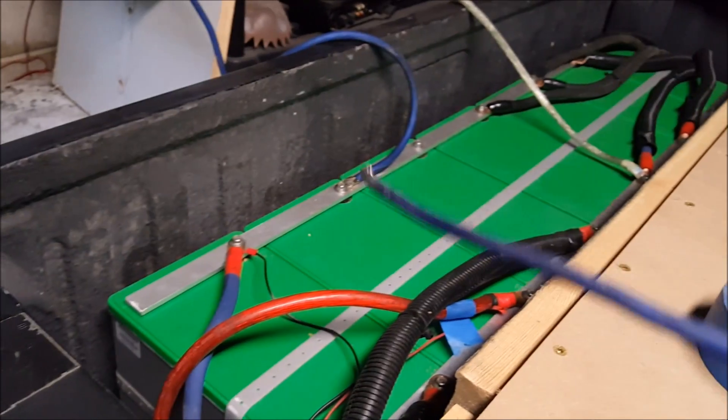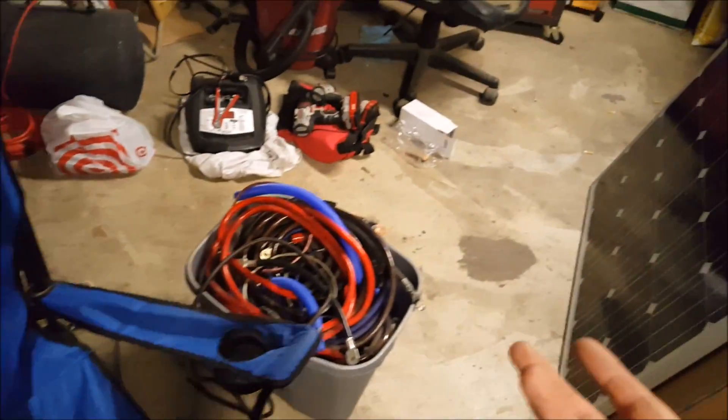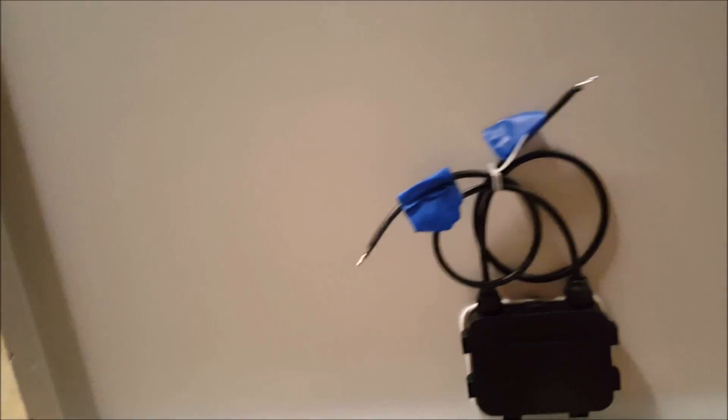Now you've seen what a Renogy 150-watt panel looks like. I've got to figure out what to do with that tree. Eight-gauge wire fits in my little cheapo charge controller, so that's what I'm going to use to connect it to my batteries. I have some long runs, so I'll put positive on one end and negative on the other end — using the whole battery bank. I also have some 10-gauge pump wire that I use as a plumber, and I'll use that temporarily until I get a continuous run of 8-gauge, because I don't want to splice pieces together and add resistance.